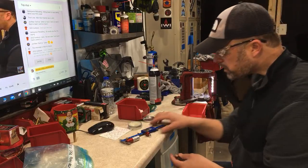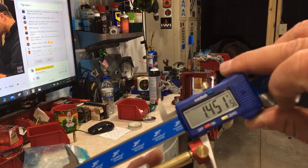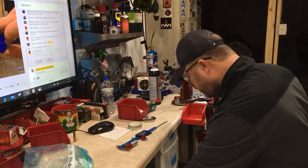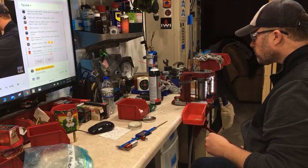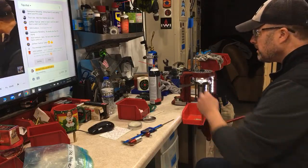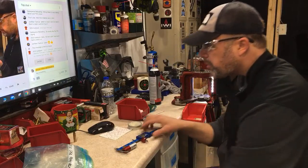And like I said, your goal is bumping this to 4.51, and if you can get every single piece exactly 4.51, just like I'm doing, then good for you. But it might be a little over. You can tell this one's actually a little over. It's 4.515. But if this actually read something like 4.505, that's still fine. You're so close to that thousandth of an inch, it's not gonna affect your accuracy, but your goal is 4.51. So if this piece rides true, runs true, reads true, I'm gonna lock this die down now. I think I need to go down just ever so slightly, and I'm gonna lock this. With the initial 4 or 5 pieces when you first get your die, I'm gonna play with that a little bit. So let's do one more piece and then I'm gonna lock down this die.